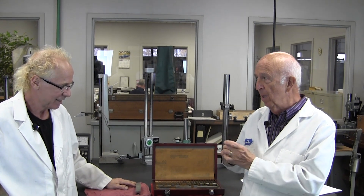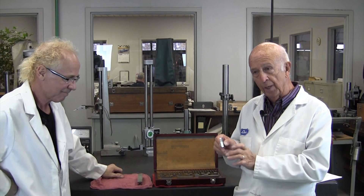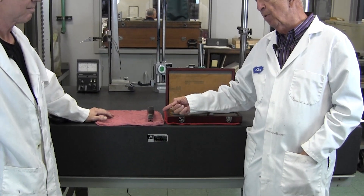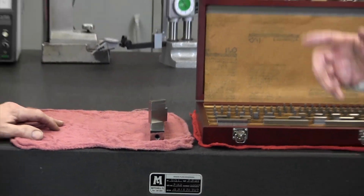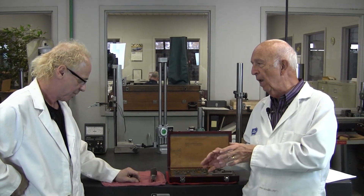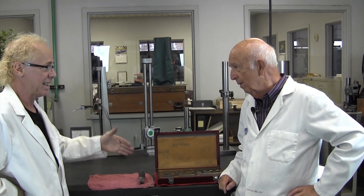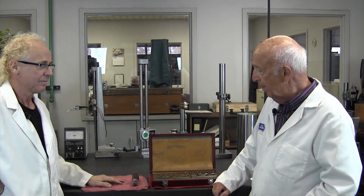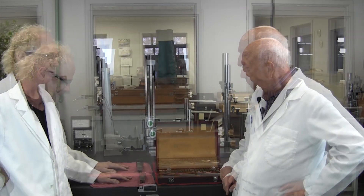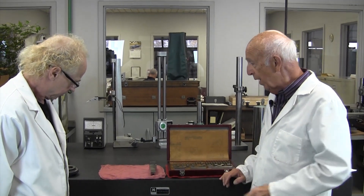So that's our stack. Double check it with either a micrometer or calipers and make sure you've got the right stack. Let it cool a little bit if you're working with close tolerance. If you're cutting a piece of lumber, you don't need that. You've got to have the right tool for the right job. If you're working with thousandths, you're sure as heck not going to use a scale. You'd probably use a micrometer first. Being that you're heating things up and changing temperatures, you've really got to take your time doing this. When I was running an OD grinder, I would put the blocks on the machine because it had coolant running through it and was room temperature, so I always let it sit there for a while. Temperature is important if you're working with close tolerance. If you're working within a thousandth or half a thousandth, it's not that critical. So that's the story with gauge blocks - that's how you use them.